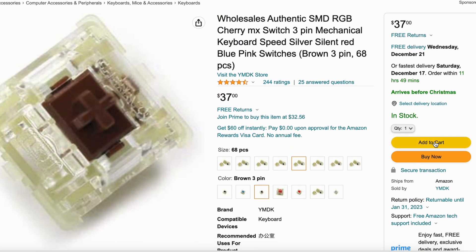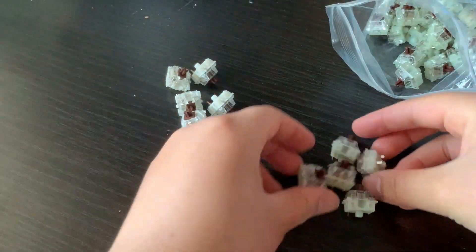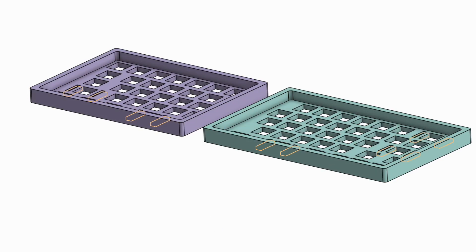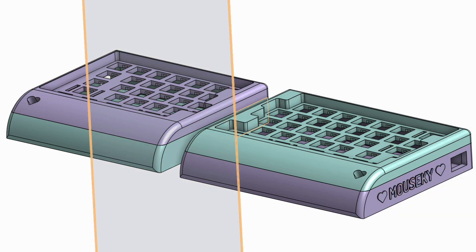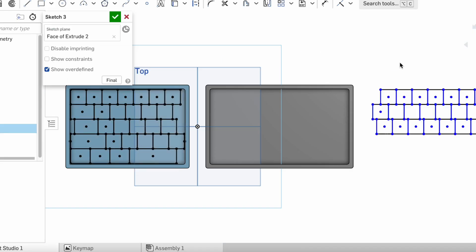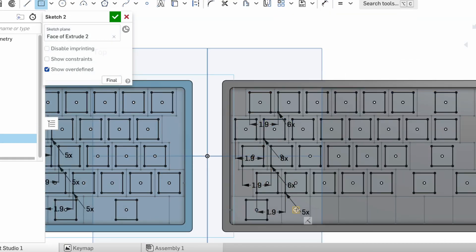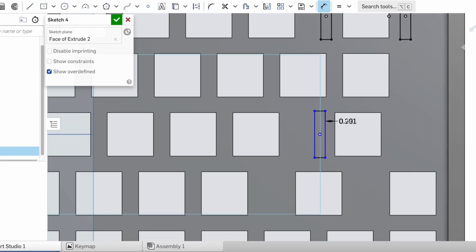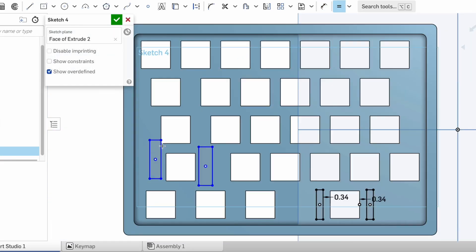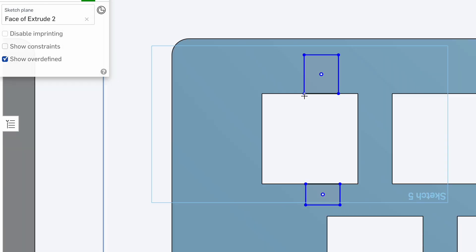I bought another pack of Cherry MX Brown key switches — for some reason the new switches were a little greener than the set I bought before. Using the key switch dimensions and the Google sheet diagram, I worked on the CAD in Onshape to get ready for 3D printing. I purchased a fresh roll of aqua teal filament specifically for this project. Here I'm simply creating boxes for laying out the placement of the keys, then drawing in squares for cutting the holes that the key switches sit inside. These additional holes are for placing stabilizers, so I only added them to the longer keys that require them. Lastly, I'm adding in small slots used for holding the key switches in place.